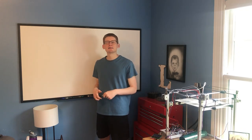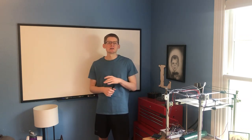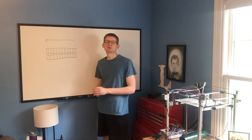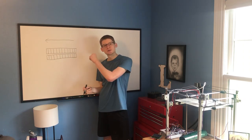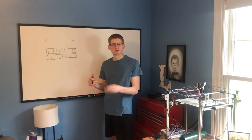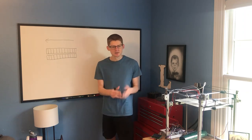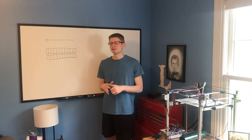The new idea is kind of the opposite of the previous one. Instead of having one long coil, you would instead have as many coils as you possibly can within a given distance. Imagine this is a coil — this represents the cross-section — except that each of these individual cells would be its own coil. In this design, the thickness of each coil would be considerably less than the length of the projectile itself — maybe a third, maybe fewer. The reason I have such high hopes for this is the same reason you want your block of steel closer to your electromagnet to apply a higher force.